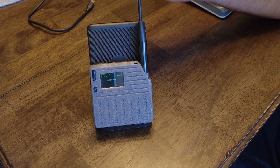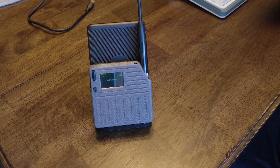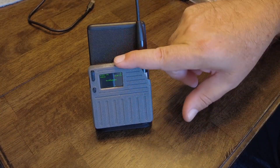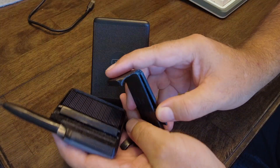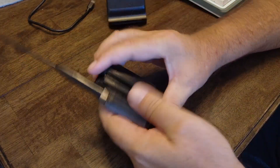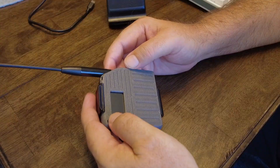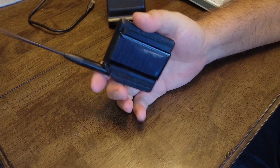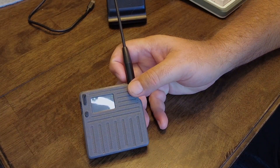It's been running non-stop and it works. The reception and transmission is as strong, if not stronger, than the ESP32-S3 or the Heltec V3 as it's known. This Heltec T114 is great, and in a case like this which is so slim. I also printed a little belt clip — I had to butcher the official belt clip to make it work because I now have a solar panel on the back — but there it is. I can just clip it onto my belt and go walking around with this mobile node. If I ever need to charge it I can charge it via USB, or I can just turn it off and let it lie in the sun for a few hours and it'll be charged. That's my little project of the week — thanks for watching.